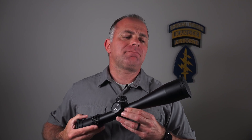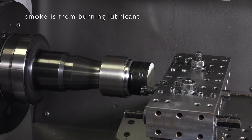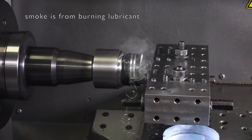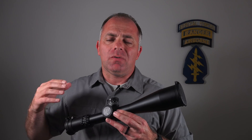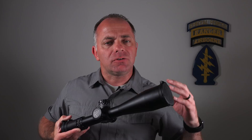Nightforce does it just the opposite. They'll put the lens in the housing first and then thread the housing. Why? When you put the lenses inside that housing, it changes size — not by much, but by a thousandth or a couple thousandths. So the only way to get around that is you have to have a little bit of slop in your threads to accommodate for the variations in sizes you're going to get.